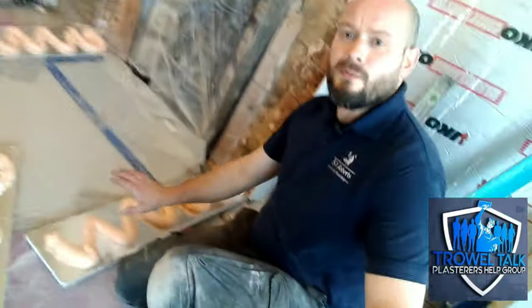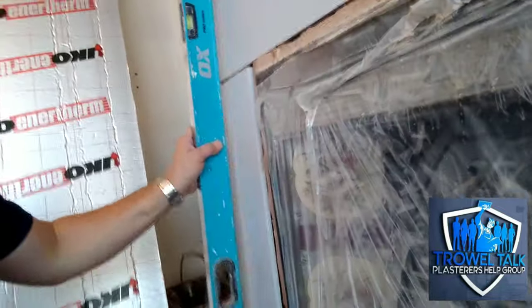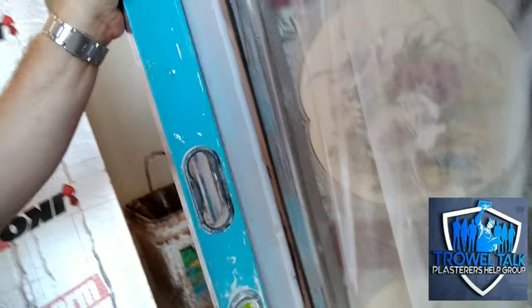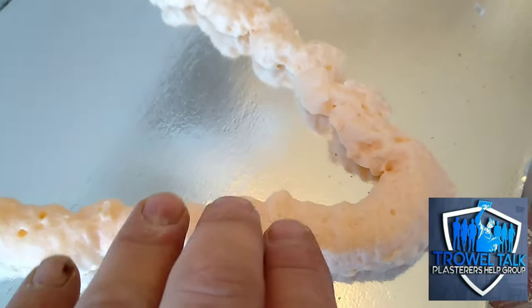When it's like that we can bond it on. This one has firmed up a little bit, it's got a skin on the adhesive and it's semi-dry, so we can actually tamp it back — a bit like dab — and it will stay where it is. Make sure if you're going onto masonry that you brush it down, PVA it, and make sure that PVA is completely dry before you use this adhesive, same as with dot and dab.